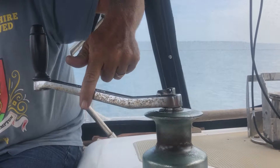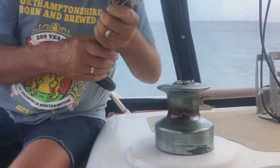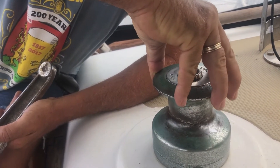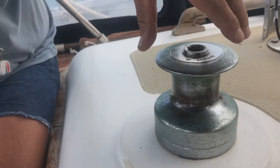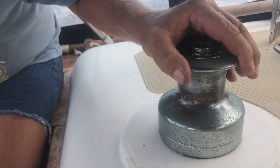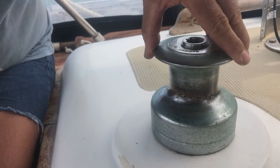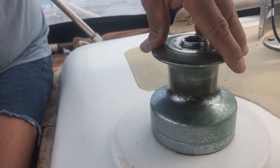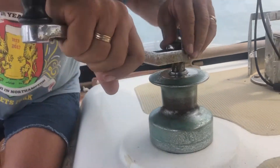It's a lot freer than it was. You should be able to check a two-speed winch to make sure it's not gummed up inside. A little trick is: turn it one way and you can hear two pawls going. You hear click, click, click, and then about every third or fourth click you'll hear a second pawl. So you should hear that plain as day — if you can't really hear the difference, then she's all gummed up. But that is as sweet as sweet, man.